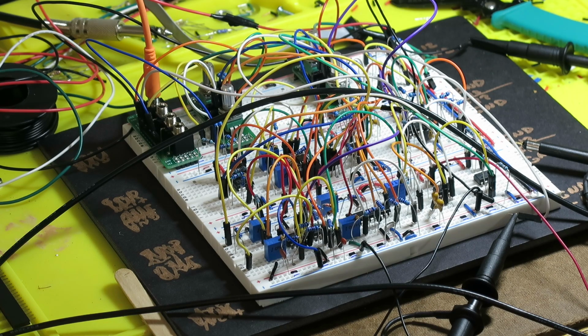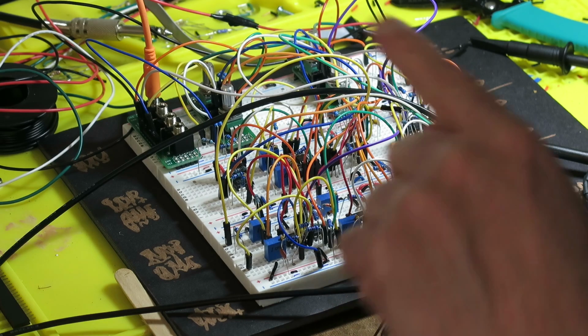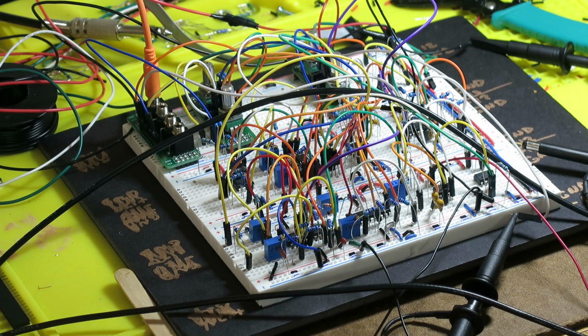So there it is. Another part here, which is kind of unusual, I mean it's usual for this kind of circuit, but unusual generally, is a tempco resistor, which is like a regular resistor except that it has a known and calibrated temperature coefficient, and that along with the matched transistors is what you use to take care of stabilizing the temperature sensitivity of this thing. And I'm going to be using one of those tempco resistors in the build, but not on the breadboard. I'm just using a regular resistor there. There's not a whole lot of point in using the tempco resistor unless it's actually bonded to the matched transistor.